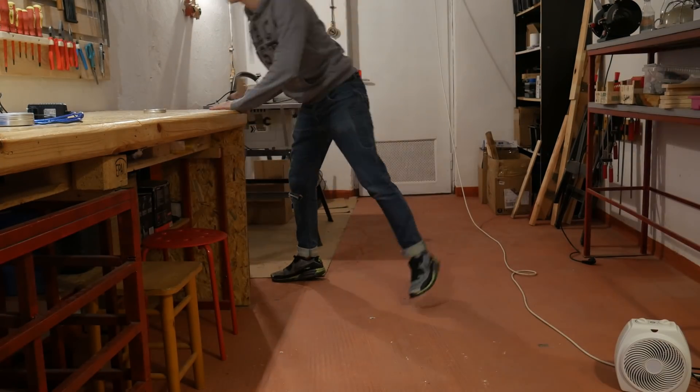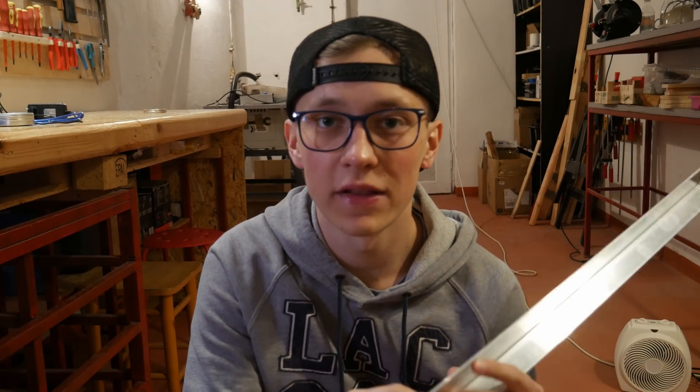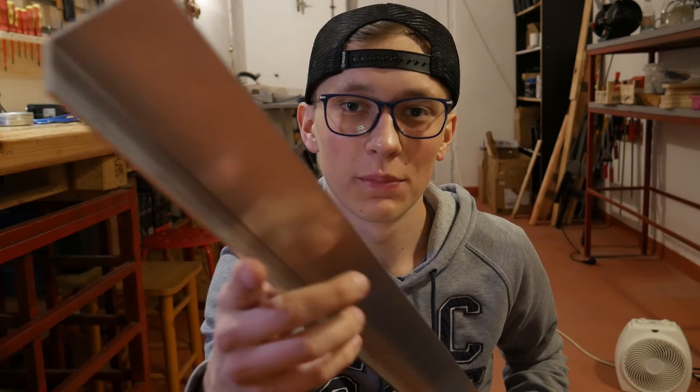And the last upgrade I want to add is this thing. As I said, I have a problem with aluminum chips getting stuck in the lead screw, and I have to protect the lead screws because I don't want to end up with a broken bit again. So hopefully this aluminum profile — 50 by 30 millimeters — will be good enough. A telescopic cover would be even better, but I didn't find anything small enough online, and those are quite expensive. This is cheap, and hopefully it will work. If not, I'll try to find another solution.